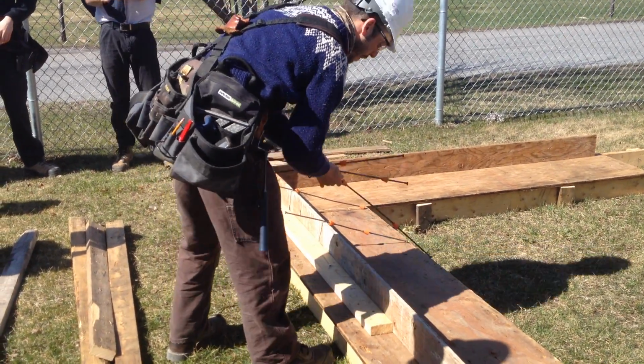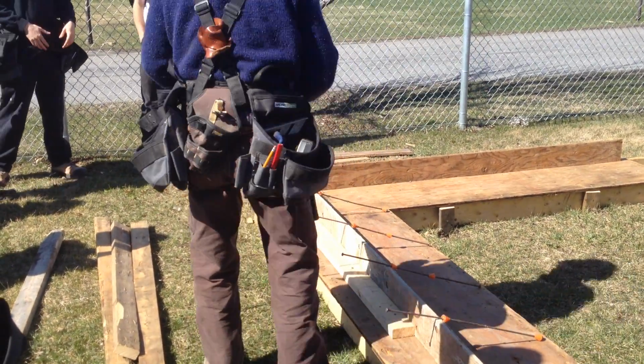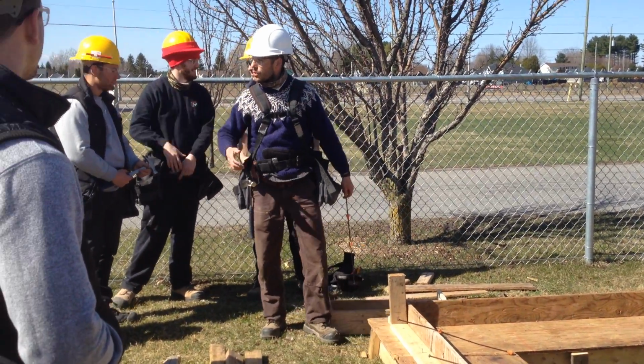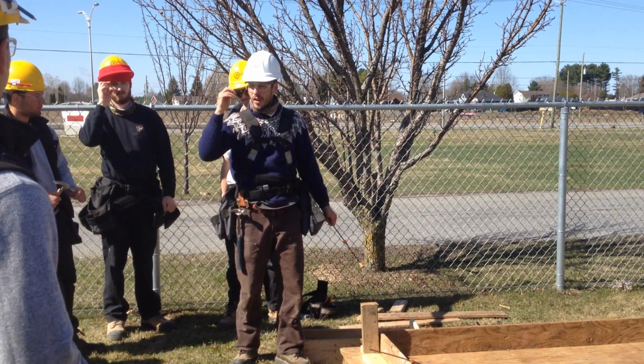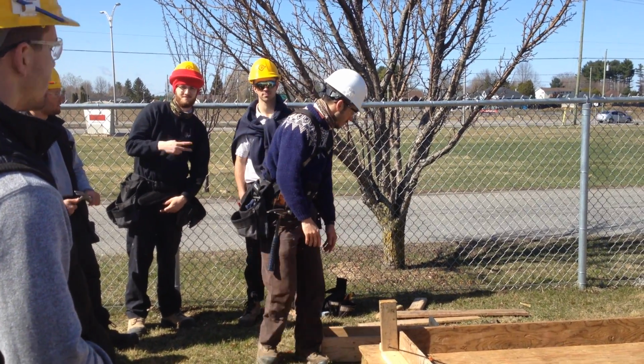Can you build the outside and inside at the same time? No, because there are going to be steel workers that are going to come and put steel between the layers, right? You do your outside wall, steel workers put in the steel, and then you close. And you need an outside wall to do all types of mechanical pathways, doorways, windows.